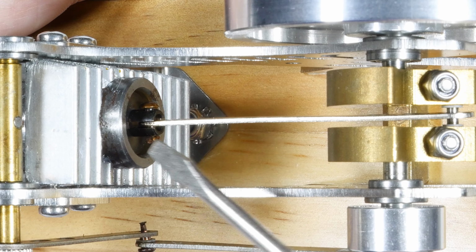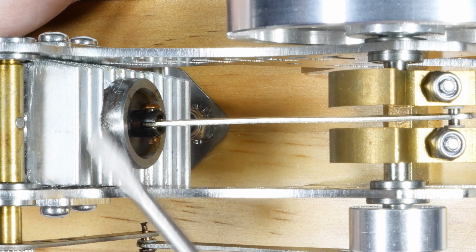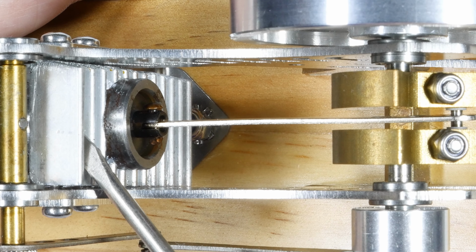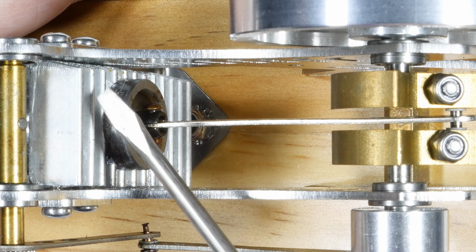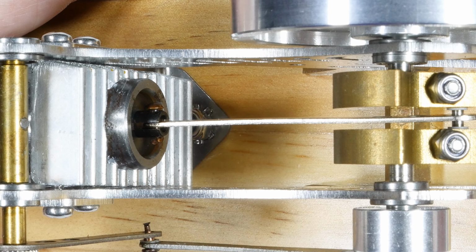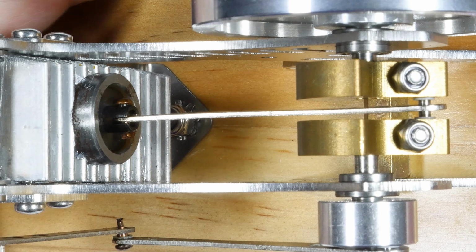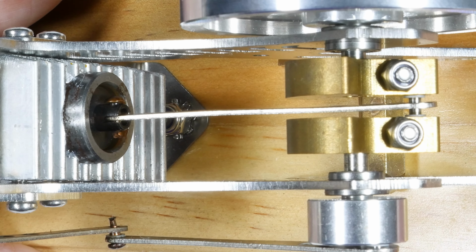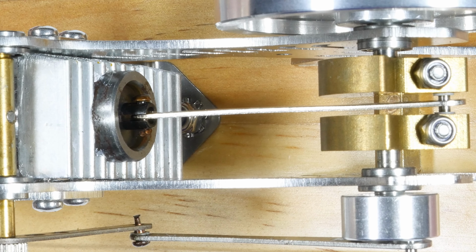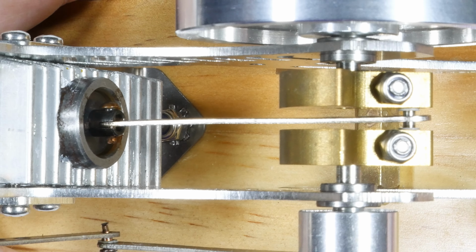So what I'm thinking about doing is moving air around this heat sink, because right now it's all convection. It's just the air gets hot and it drifts away by itself. If I could somehow move air against here, then that would help. I thought about using a fan, but you know, that's kind of cheating. And also a fan will destabilize the flame. And if the flame is not directly in front of that port, this thing quits immediately. So you need a steady flame. I tried this thing here, the flame screen. It helps. But if you have any kind of serious draft, it just doesn't hold up.